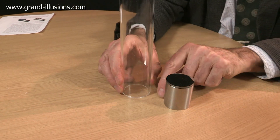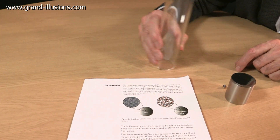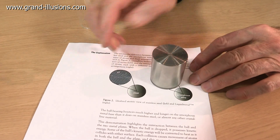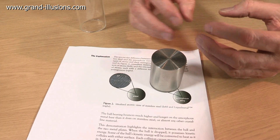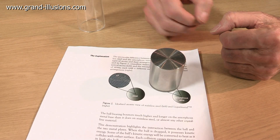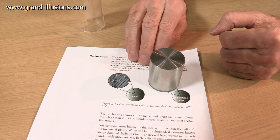What's the explanation? Well, in the literature they gave you they had a nice diagram showing atomic structures in fairly simple form. The stainless steel has a nice lattice, and when something hits it - a blow, in this case a ball bearing - all the pieces can slide past each other and distort slightly, and so absorb energy. So the ball loses energy and then gets lower and lower very quickly and decays.